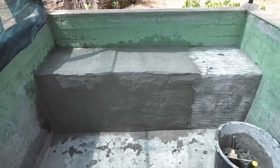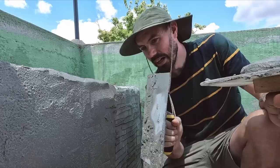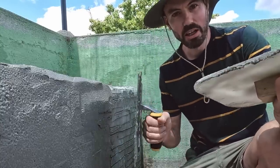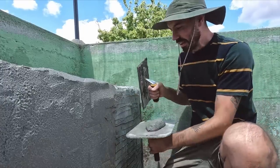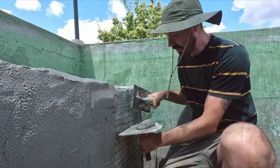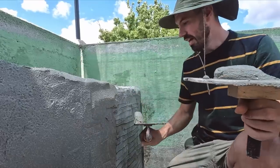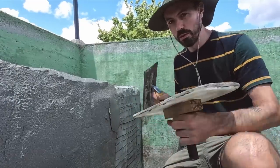So far so good - I'm about three quarters of the way through. This top coat is going on so much smoother than yesterday. Learning from yesterday's mix, I definitely needed to make the mix a bit wetter because it's just so nice and smooth and sticks much easier with less work to push it in. One tip: when you have the plaster on your hawk, they often say hold it up and push it off, but I actually find it's way more difficult doing that. The thing I find easiest is to scrape some off the hawk with your backhand, then just push it straight up - so much more controlled, you can get the same amount every time and get a much better feel for it.